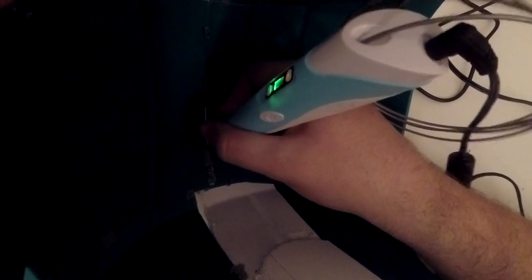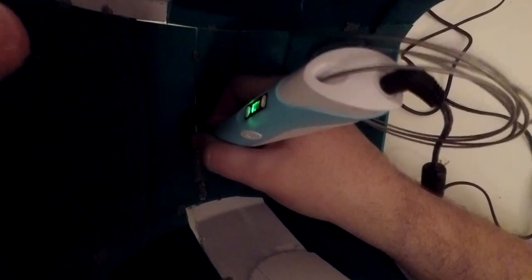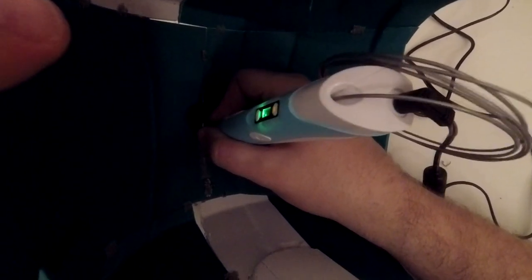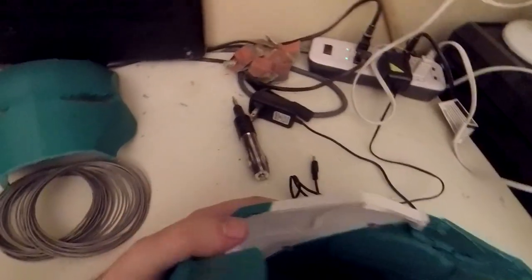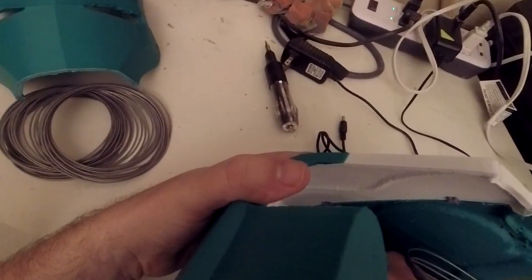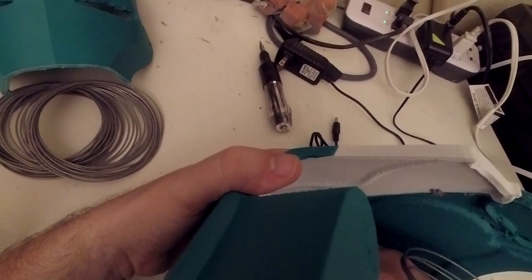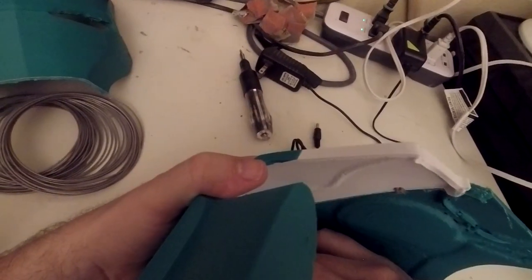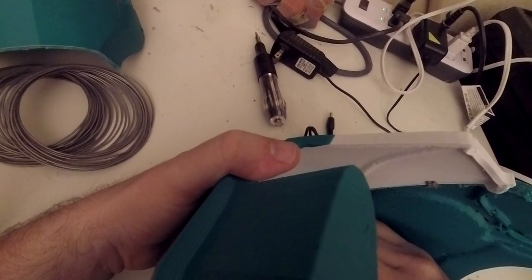When welding, make sure you're actually heating up both sides of the seam and putting down new material. This new material will bind the two sides together, and when you heat it up it attaches to that new binding middle section. It's a back-and-forth motion - left right, and slowly move up as you put down more material. If you're adding just the tiniest little stream of material you're going too slow. Doing this right will make sure you have a robust seam, not just the smallest bit of filament. It's not unlike normal welding - you're heating up the face of it and adding ABS material between the seams.